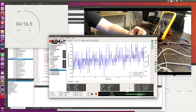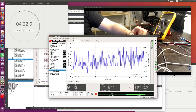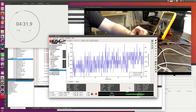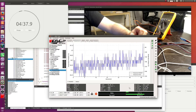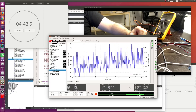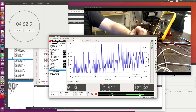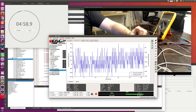Also notice that the copper on this PCB is only 35 micrometers. So even at 35 micrometer copper you can run those kinds of currents for extended amounts of time. The final version is probably going to have 70 micrometers, so it's going to be even safer. We are at almost five minutes at 70 amps, or now 50 amps continuously for the last two minutes, and it seems to keep up pretty well.